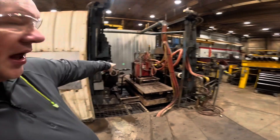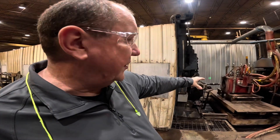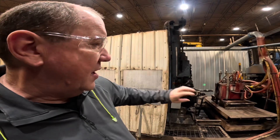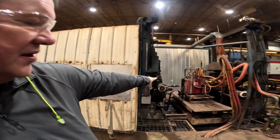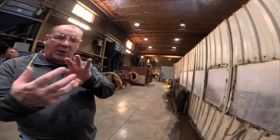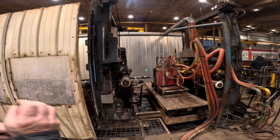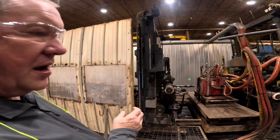One of these pipes is going to drop on here. This block is an electromagnet — it runs a magnetic field so strong it's going to heat this pipe up super red hot, super fast as it passes through. This is the cooling lance — the water jet. You can see the little mushroom head on top. The water sprays backwards, so as the pipe comes through that coil it's going to be red hot, then hit that water lance.